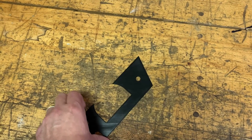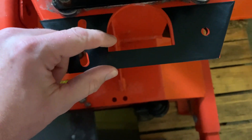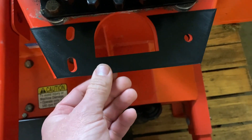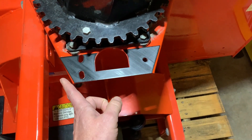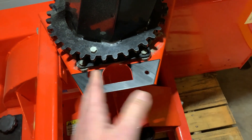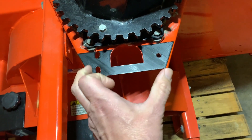The first 3D printed part is done — this is just half a millimeter thick to check the drawing dimensions. With our paper rubbing and guesswork it's pretty close, but I'm actually too close on one end; the washers are in the way and I can't slide it far enough forward. I made some adjustments and this is V2 — it is a perfect fit. Interestingly, the angle on one side of the actual snowblower bend is slightly different from the other, but no big deal. All we really need is the location of the open area, the slots, and the hole to make our piece that fits on top.